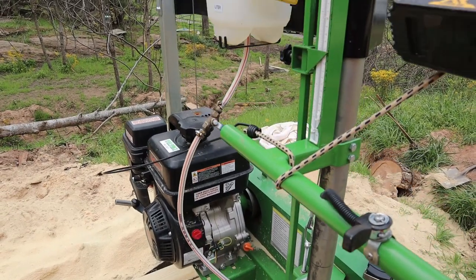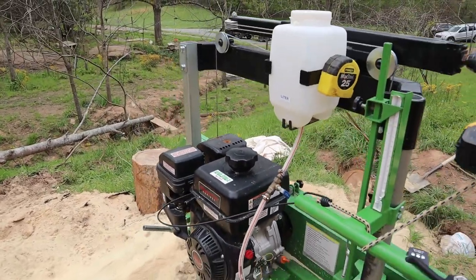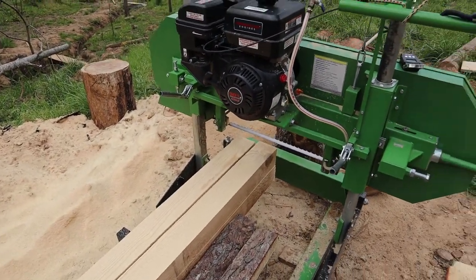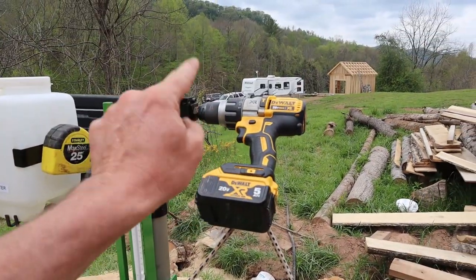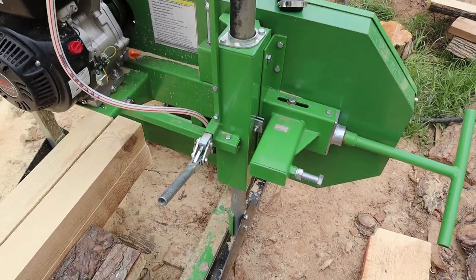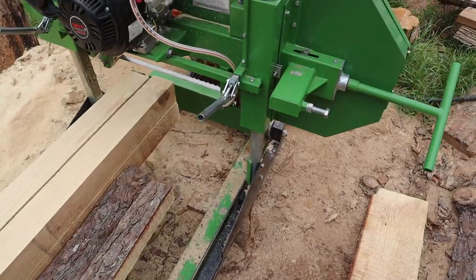And that thing books, look at it. All right, so I put it on high torque mode, which gives it the strength it needs and also the lower rotation. So, okay, we're clear now. I could get those logs out of the way. So guys, the problem is if I take this drill off, like just unlock it and remove it, and this thing is unlocked, that will allow the bandsaw to just slip down and crash down. And that's not very safe.